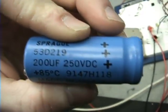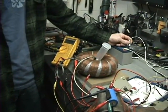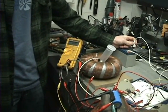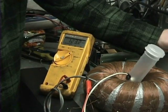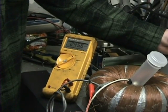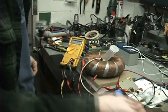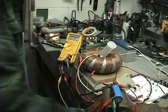With nothing hooked up to the rectifier, now I've got this 200 microfarad 250 volt DC cap and I'm going to hook it up to this rectifier. I can just pulse it and this thing will be charged up to its maximum value. I'm going to just tap this power — I've got my capacitor hooked up and that's the voltage reading on it. It jumped up to 75 volts. Tap it again — 125, then 200 — we're over our limit so I'm going to short it out. It did charge up. I'll hold it on until we get up there — above the limit already, that was quick.